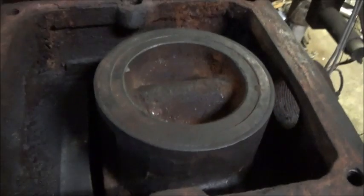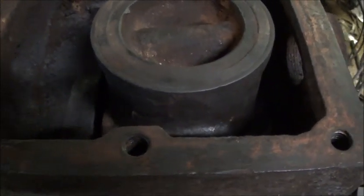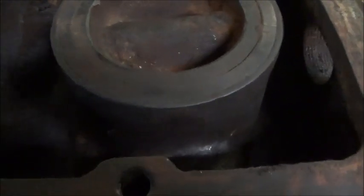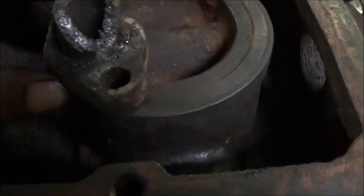I've got this surface done on the surface grinder. You can see there's some spots in it, but I don't think they're going to affect anything — you can see them but you really can't feel them. What we're going to do now is build something to lap this in. We need to move it about three inches back and forth, then we're going to take some valve grinding compound and let this thing lap for half a day or so, and we'll get it to where it works really good. Mark which side's the top so we don't have to worry about getting it in backwards after we lap it.